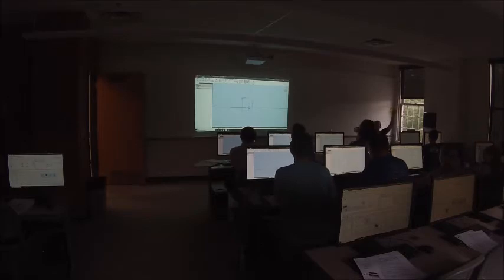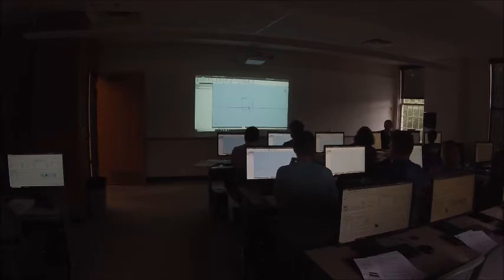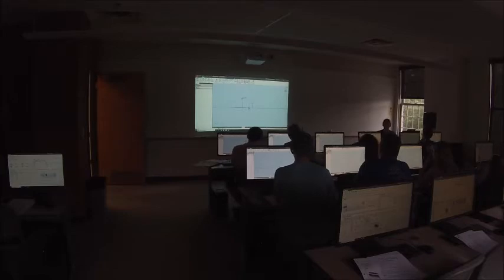Now we have the two important features, right? These two holes are the really important features of the part. Now we're going to build the part around this. This is an important technique. You want to locate the stuff that's important first, because in most cases the outside profile of a bracket really doesn't make a big difference, right? You want to get the bearing holes in place first, because that's stuff that's really important. Then you model the outside of the bracket to give yourself enough room to mount it. And then the last thing you do is you go in and add the actual mounting holes themselves in cases like this. And you'll see me follow that workflow in the video.